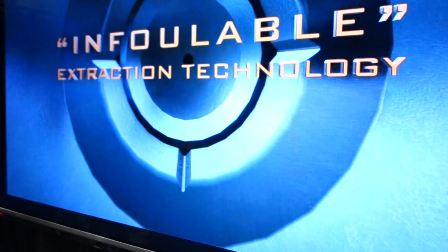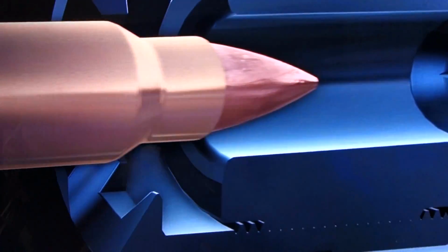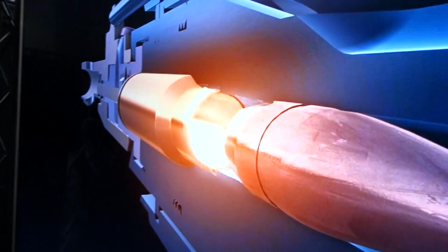It's found in all POF 416 and POF 308 guns. Every product POF will ever build will have this feature in it. It'll work in bolt guns, in belt-fed guns, in large caliber, small caliber. If you want to put it in a 30-30 Winchester, it'll do the same. We're using the gases to work the neck. The case moves the most in the neck when the projectile leaves. And you're also delaying the action, right? The 45-degree angle or whatever delays.